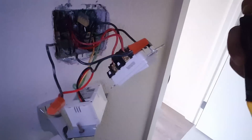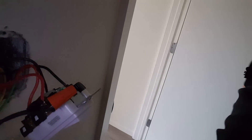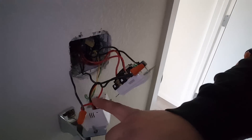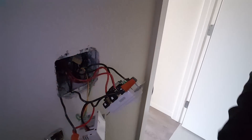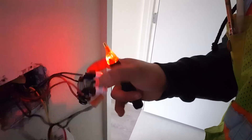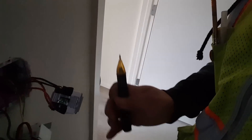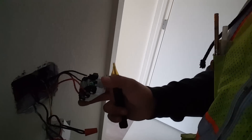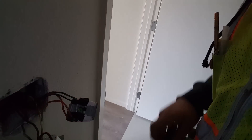Alright, taking it apart. This is a common mistake — the red wire is supposed to be the switch leg, meaning it's on the output side of the switch. I'm going to test it: the switch leg has power but the line side doesn't. So in this case I just have to flip those around. You can see this switch works up and down — there are two reds on one side and two blacks on the other. Usually people put two reds up top and two blacks on the bottom, or vice versa, and it doesn't work.